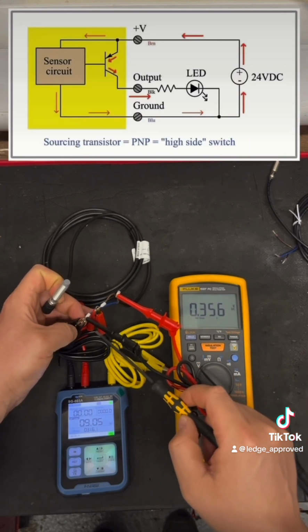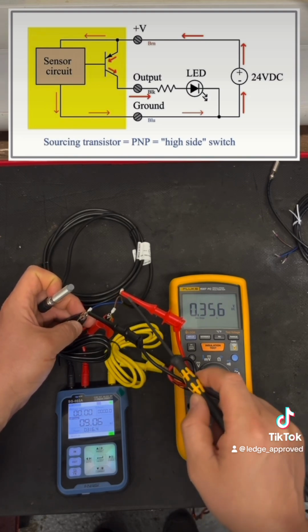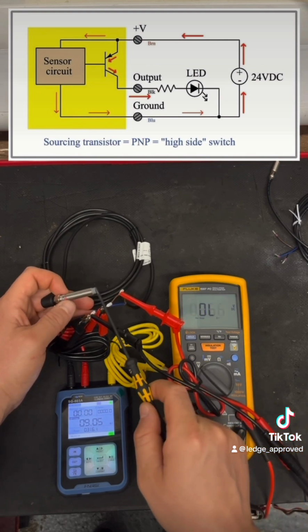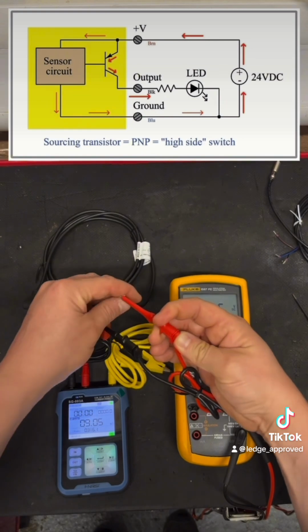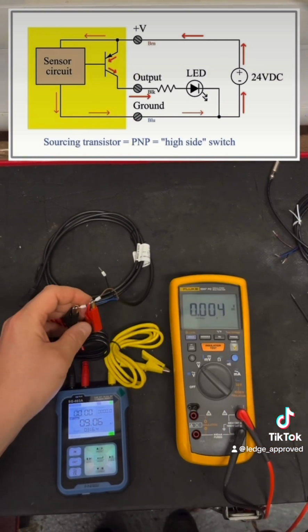With the little diagram coming up, this is what you can see. So we've got voltage coming in, now nothing's going to be going through that transistor until the sensor head's made, and then that's giving the signal voltage to the base of the transistor, making it like a PCB relay really. Nothing's going to come through, and this is before the load, so this is PNP because we're switching the power side of it.